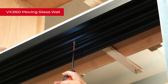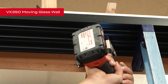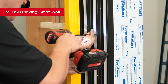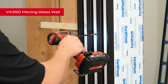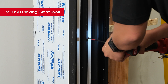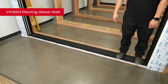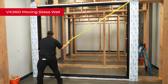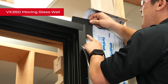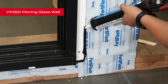Apply shimming to all the anchor points. When anchoring through the jambs, be certain to offset the screw locations so that it lines up with the indentation line in the jamb. This will eliminate any interference with the middle leg of the jamb cover when applying it later in the process. Once anchoring is finished, walk on the track the full length to settle the sealant. We will then cross tape the frame corner to ensure it is square. Apply self-adhesive corners to the main frame to cover the gap, then apply sealant around the edges and tool the sealant flat.